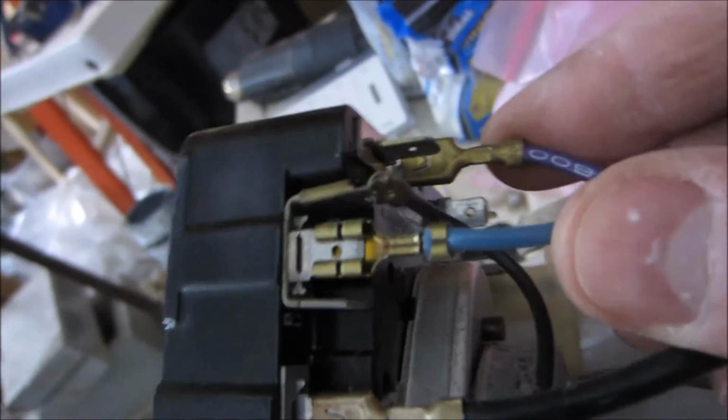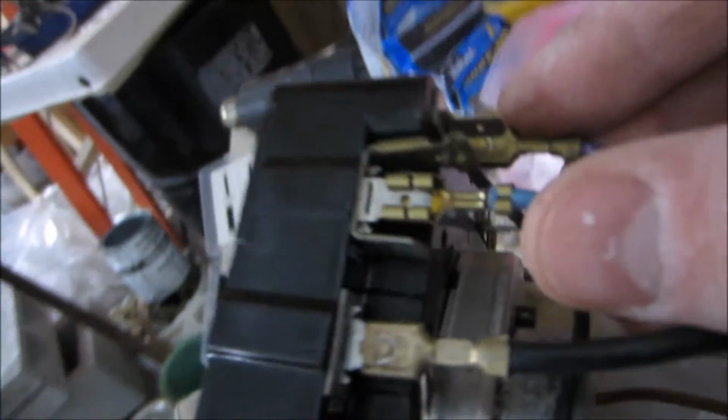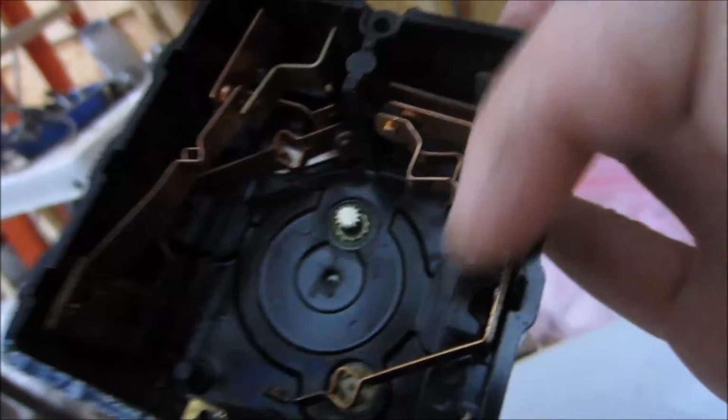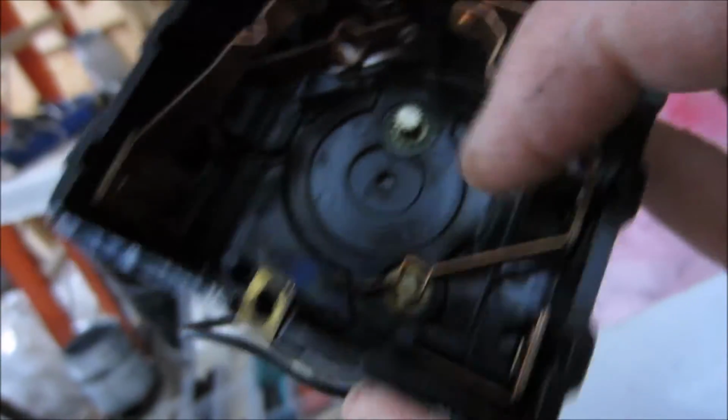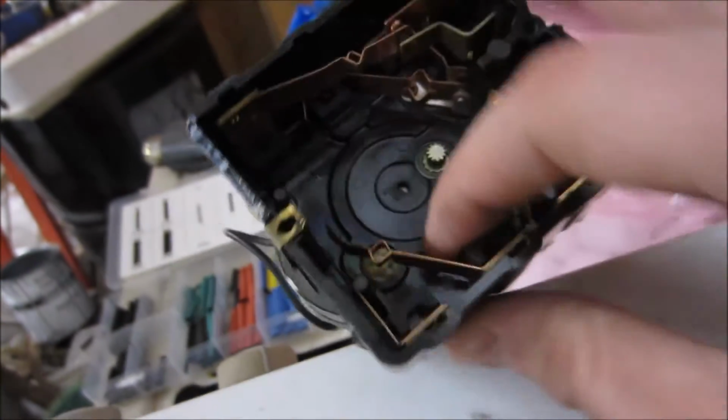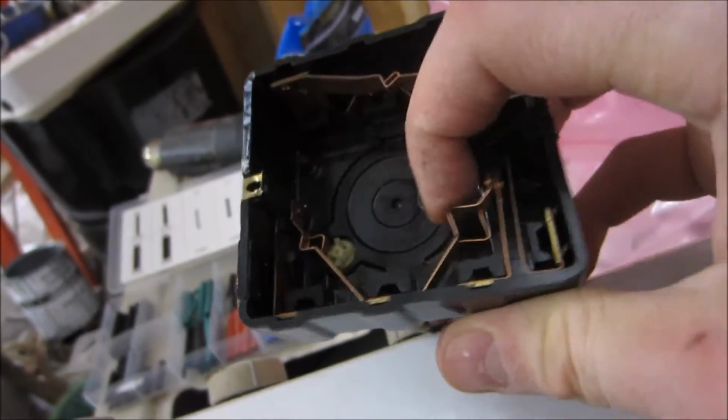So I looked at this and I saw all these wires here. So I knew to short these together, and I knew to short this heavier one together because it's right here in the center. And what was here? Well, that was a red, another heavy gauge wire. I really didn't take the entire wiring apart, but what I did was I just looked at the contactors. And that's how I determined what I should short together.